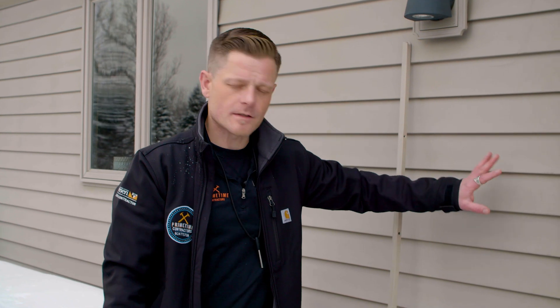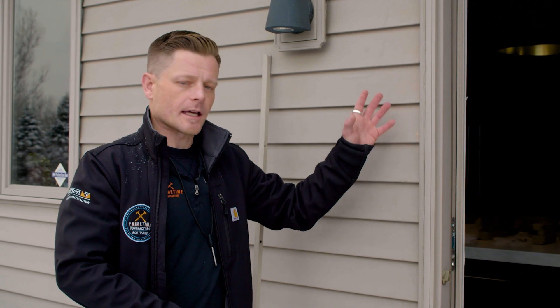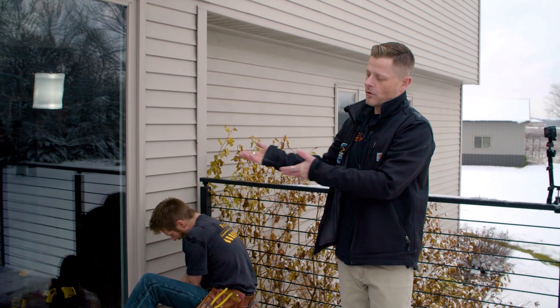Something we're going to be extra careful with today is the vinyl siding — it looks a little bit older so it could be somewhat brittle. In this installation method we're going to cut the caulk and not take the siding off. On a typical window you might see a nailing fin where we would need to remove the vinyl siding to flash it properly, but in this scenario we won't need to. We're going to use a multi-tool and zip it up the fin all the way around and hopefully free that door up so we can pull it out.